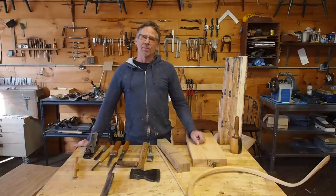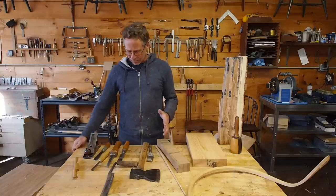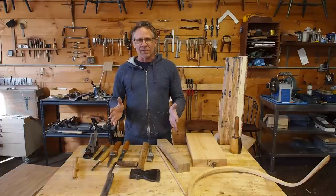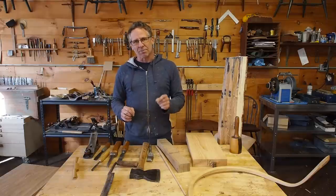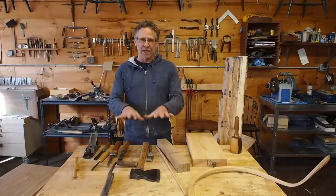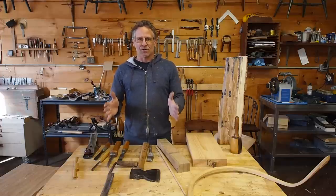But it's all made up of high carbon steel, and I want to just take a minute to think about high carbon steel and what it is, because I think it helps when you're understanding about sharpening it and using it. So basically, I think of it as a bunch of marbles, which are the atoms, in a box. And they don't quite fit in the box perfectly, so they can rattle around a little bit in there. When you add the carbon, it's another smaller marble that fits in between all of the iron marbles and locks them in place. All of a sudden, they meet the edge of the box, and it's a rigid structure. Okay, but it's still probably got some pliability to it.